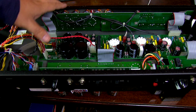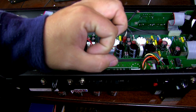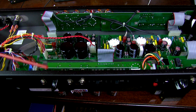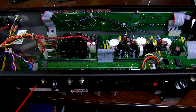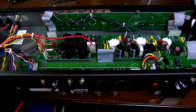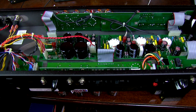You can't do this from the front of the amp. You have to actually get inside the potentiometers. You'll see the potentiometers — it's a Sakura — so you have that circle for the potentiometer, and there's a little tiny spot that just fits the tip of this in. You squirt this in and you'll be a little scared the first time because it looks like you're squirting liquid everywhere, but it dissipates and goes away. I had a huge shot right here and it's completely dry.